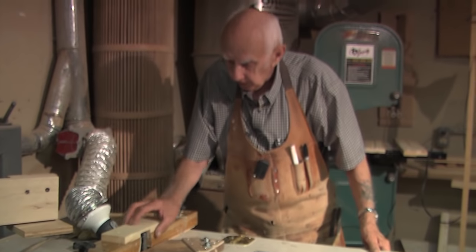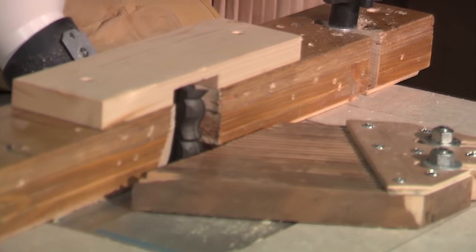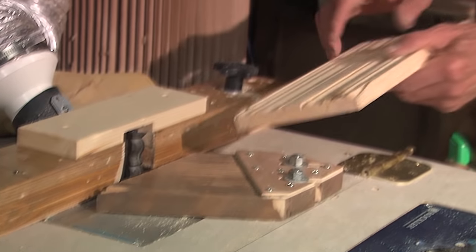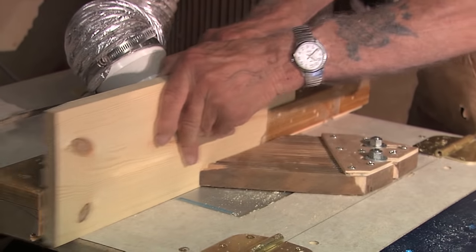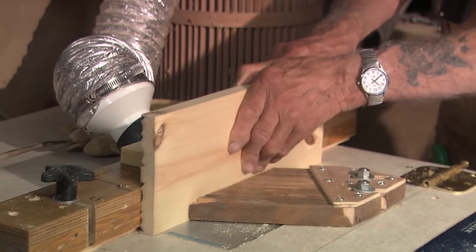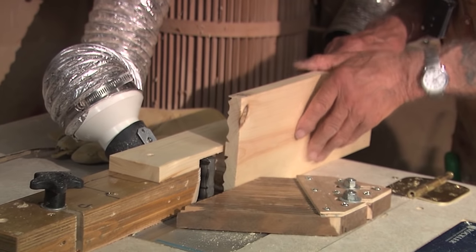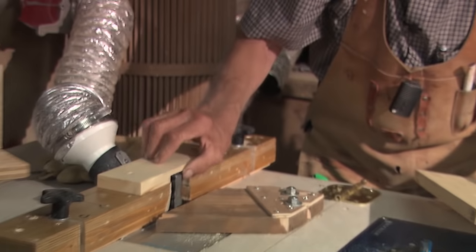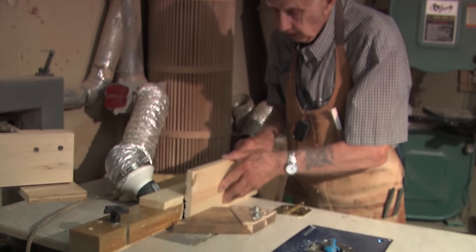Right now I was making crown molding and the bit head is very high — about two and a half inches. If you're going to do that, don't try to cut a narrow piece and go through it. Take a board at least twice as wide and shove the whole board through — you get a good hold of it. It's good to have a feather board on it. I put a guard on top here so I can't even get my hands down into the router, because it can really damage your hands.